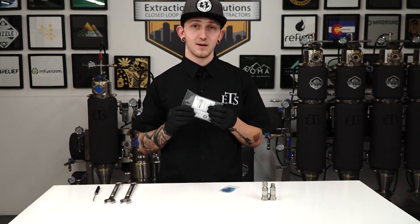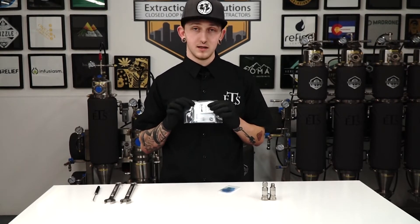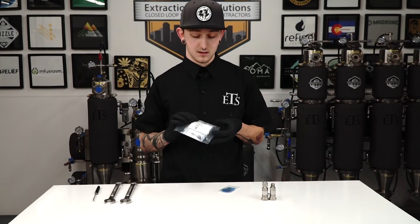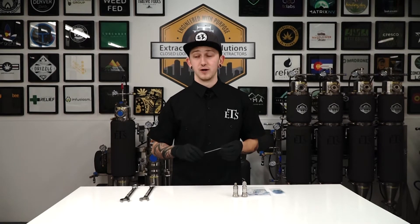When you want to use the spring and stopper kit is when the spring itself loses tension, or every quarter just to do preventative maintenance. Tools you'll need will be two 3/4 wrenches — you can also go with a 19mm or a crescent wrench if you don't have two 3/4s — and a thread pick to help remove O-rings and clear out any dirt or debris.